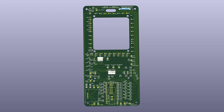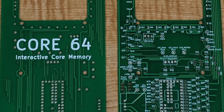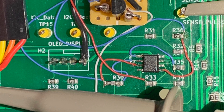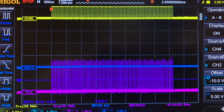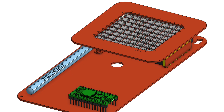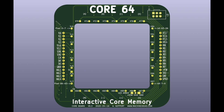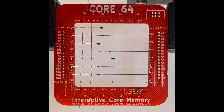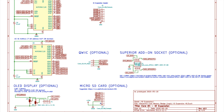The first formal prototype is this single board design in the classic green solder mask. This was also my first complete circuit board design project from concept to prototype. I used KiCad with a great tutorial series by Sean Heimel and DigiKey. This prototype runs smoothly with all 20 of the matrix drive transistors directly connected to the Teensy LC I/O pins. I maxed out the available I/O and even had to overlap some functions by sharing pins. The second prototype is this dual board design. To provide more I/O, I added two I/O expanders. I just got this one working and it is running much slower than the first prototype because I'm using the I/O expanders. Although I see some room for optimization, I think I'll steer away from the I/O expanders and go back to direct I/O because it's about 100 times faster.